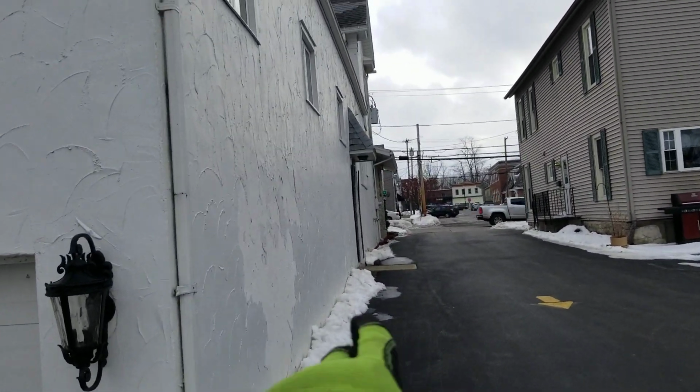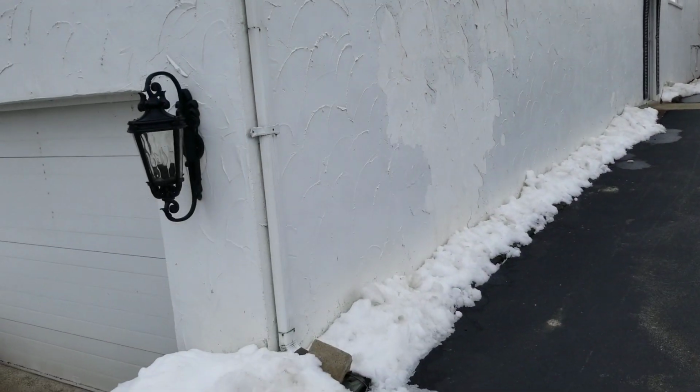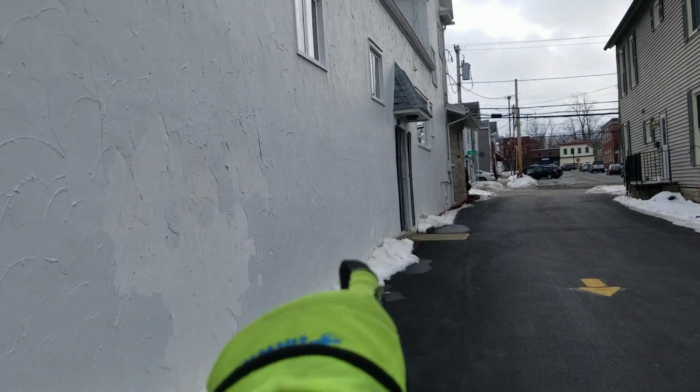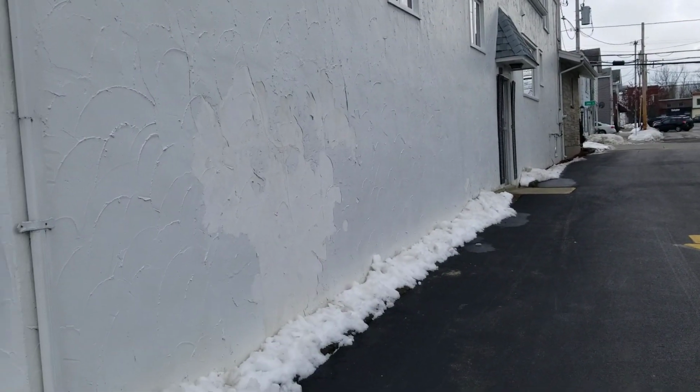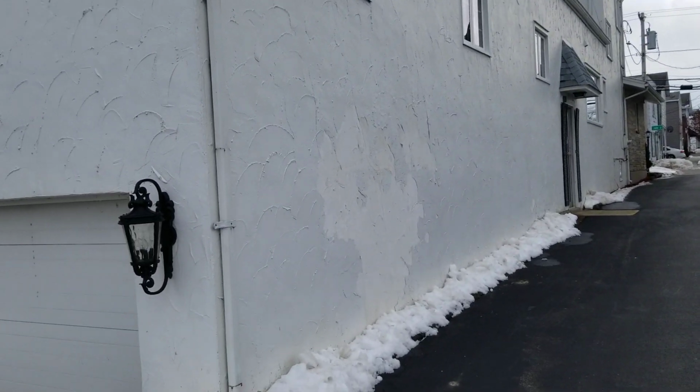Down at the bottom edge where the driveway meets, because this has a bit of an incline, we're going to end up running a nice thick .027 coil with a little bit of a flash out, and then we'll step our siding down. We'll come out like 15 feet, giving ourselves maybe no more than an 8 inch aluminum stock on both sides.